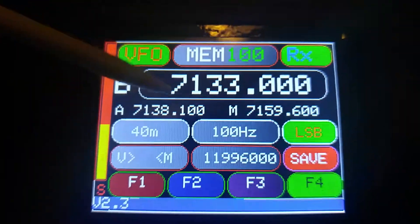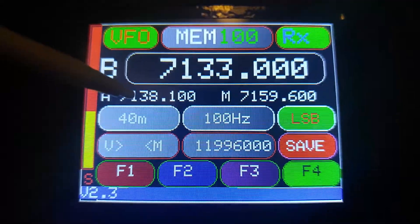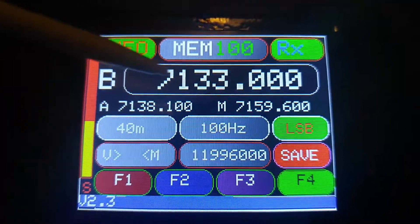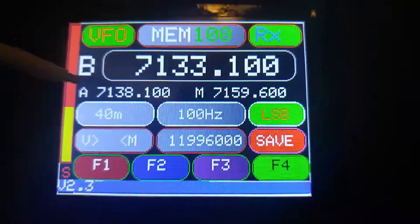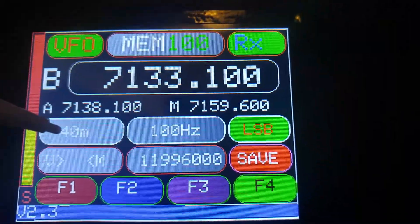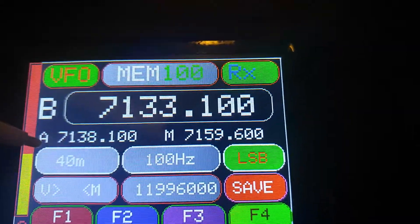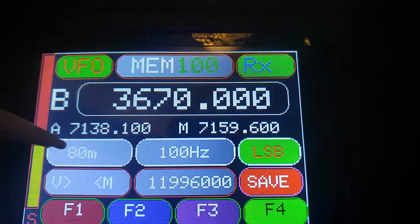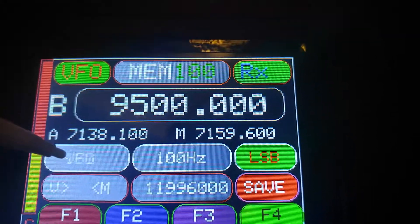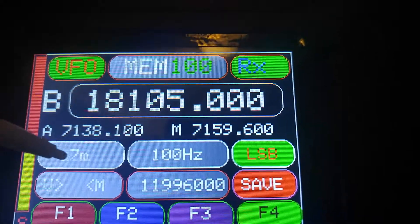I'll just leave it on B at the moment. Down below here it shows you what is in the other VFOs. That's your main dial, and you can just touch the left or the right and it'll go up and down. We have the band select — that's all the code for it — so all the digital pins are assigned that will turn on a relay for your band select switch, if you wish. It'll cycle through 80 and you can program whatever you wish in there. These are just some of the default ones. I'll put it back to 40.